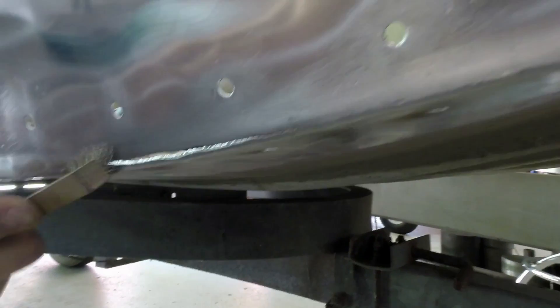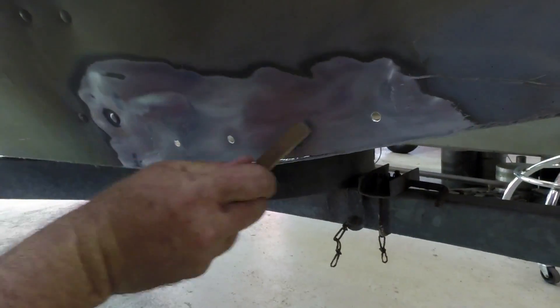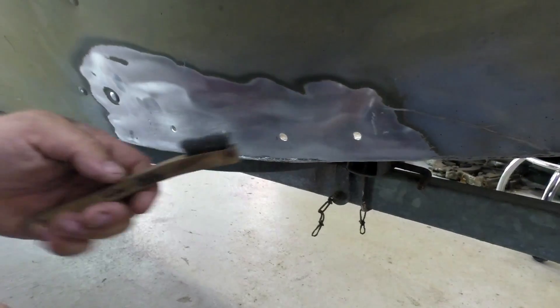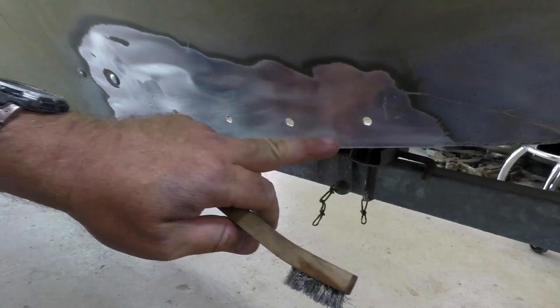It's very, very critical that we get this out of here, because what will happen is these bits of paint will liquefy when we weld and they'll float into our weld puddle and make a wreck of the weld. So we're going to use a stainless steel wire brush. We've got to get in there and give it some effort. We've used some acetone and a rag to wipe down the whole inside, outside, bottom, and inside, and then we took a wire brush — it pretty much trashed the brush — and scrubbed the inside out real well too.